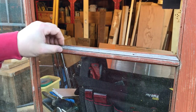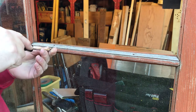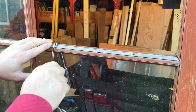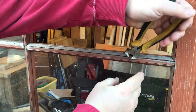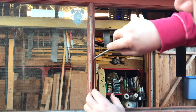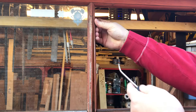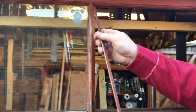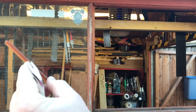Now we've got to remove these old timber glazing bars. Remember this is old 10–12 year old wood so it could break. I'm going to use my nail pullers. Using the same technique as upholstery work — put your tool in and twist it. Oh, broke the wood a little bit. It's critical we don't break these otherwise the job gets a lot harder. That one came out — just got a bit of a nail on the back; I'll push that out and keep the bead ready to reuse.